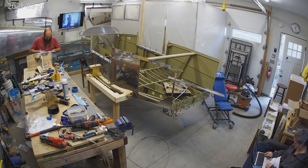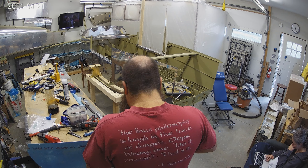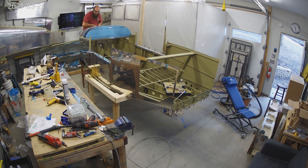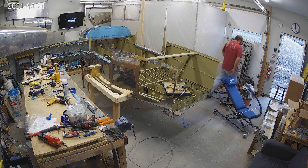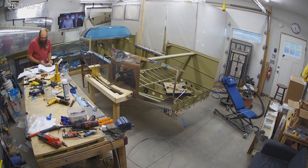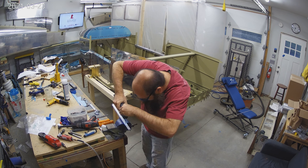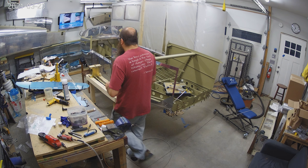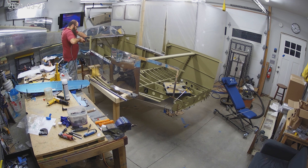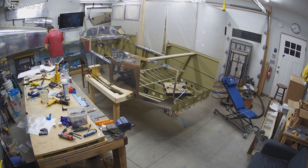This was a little frustrating for me. I did it twice, and then wasn't sure if I had another spare piece of angle. This uses eighth-inch thick angle, which is not as common in the RVs — it's for the longerons, and it turns out also for the seat backs for the rear seats. That's what saved me, because I didn't use the RV seats in the RV-9 — I used seats from Classic Aero. So I had leftover angle, which was fantastic. It saves me from having to order stuff. Third time's the charm — I was able to make the third one and it works fine.